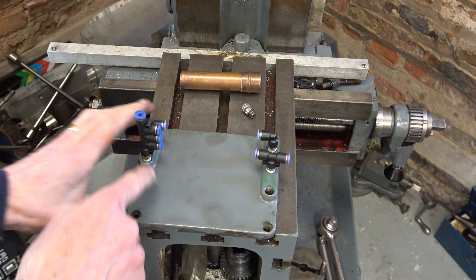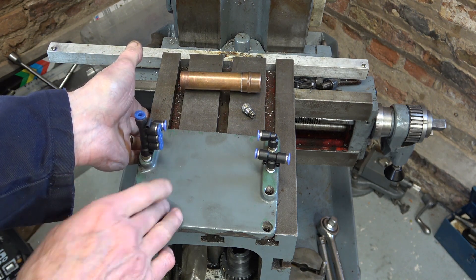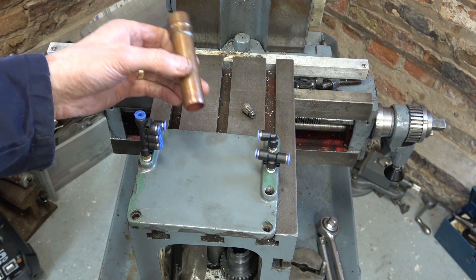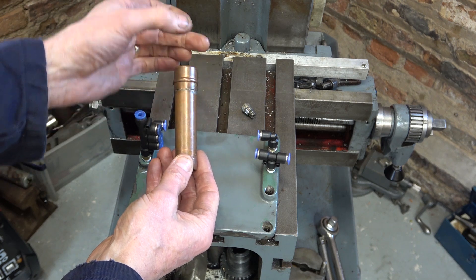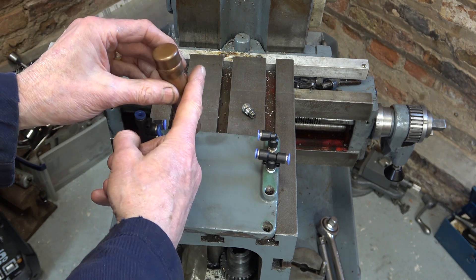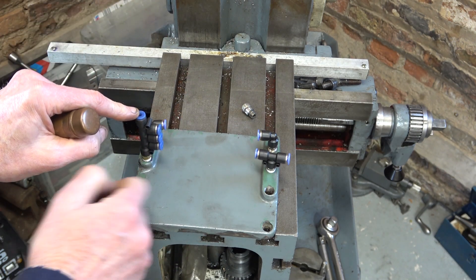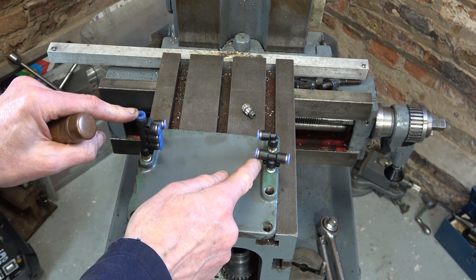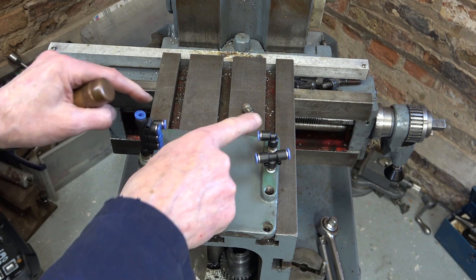This is how the oiler system is shaping up. The top here — that long sticky-out thing — would be protected by the belt housing casing, so you wouldn't really be able to knock it. I'll make some kind of oil chamber. The idea is I'd get a new piece of pipe and just drop it on top as a cap. I've got a brass fitting that could go on the end, with a bracket, going further back on the shaper. The pipe would come out into that end, and one of these would feed the main bull gear bearing directly, with another one to a T in the center feeding two others.